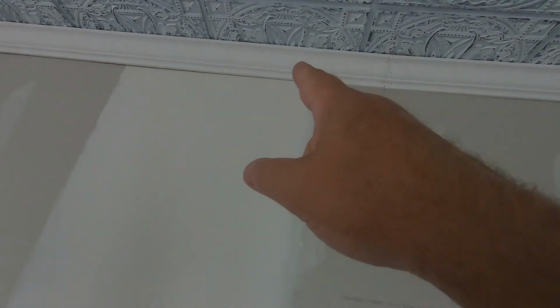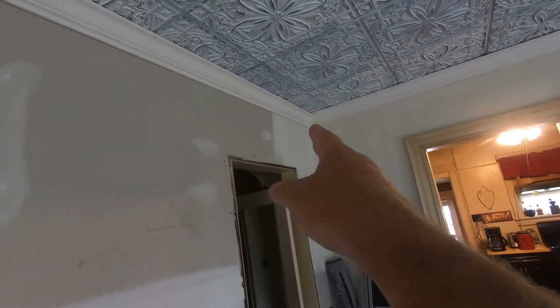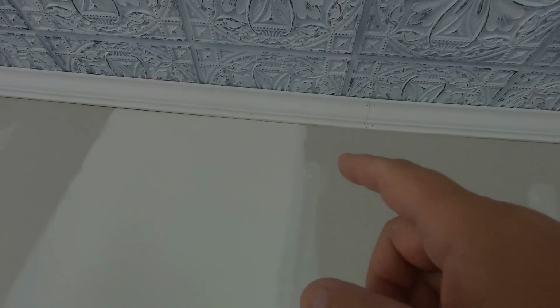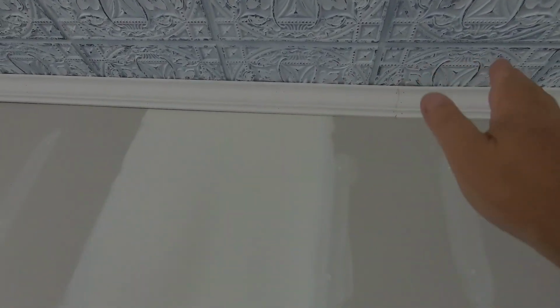What happened is the nailer here and the nailer over there went to put the molding up, and they were just dangling in there. On a positive note, my two little 1/4-inch holes that I filled with snot and then put the rest on top of that, they held. When I pulled the nailers off, they looked like they had little glued dowels on them. So I took a damp sponge, went over it, glued two new nailers up, and bam, they stuck like glue. So that's good to go.